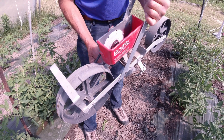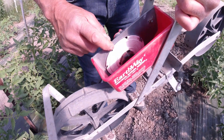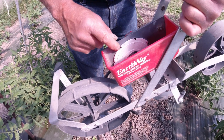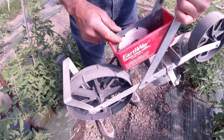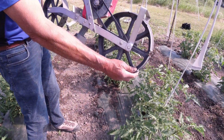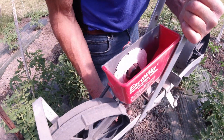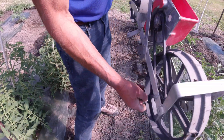I want to say a little more about how the seeder works. I've got my lettuce seed inside the hopper and my seed plate in place. Each one of these little holes on the seed plate picks up your seed — lettuce or whatever. It can plant peas, radishes, corn, and beans, but there are different sized seed plates for those. The way the machine works is always the same. As I'm going down, there's a belt that drives the hopper and drives the lettuce seed around on the plate.